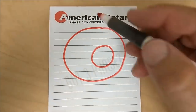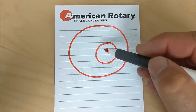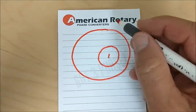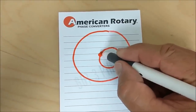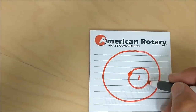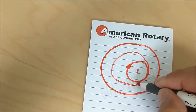Okay, here's the problem. Here's the existing surface of the material, and here is the hole that you want to move. This center has got to go from here over to here. Now, ideally, what you need to do is take a look at where the center needs to be and the extent of one of the points on the bad feature, and that is your new diameter minimum.